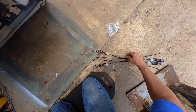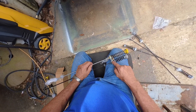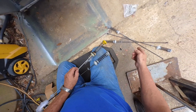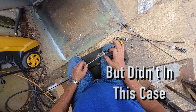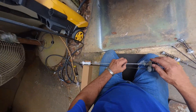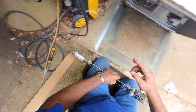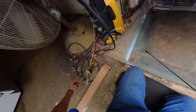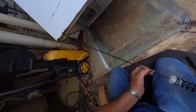I've got four here — I've got the replacements. I'm just going to hang these rods in, but before I do I want to make sure these are the same. You would measure from here. Some different manufacturers — for this rod here, they're not as good as the original manufacturer because you have a longer barrel here for the dampening, the linear dampener. You've got a shorter one here. But the thing is, you want the rod length here to match the rod length here.